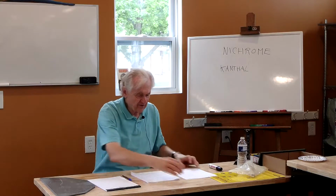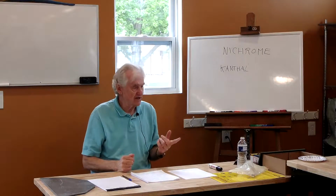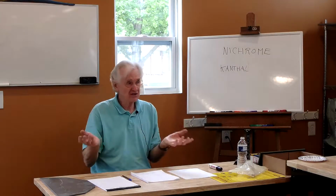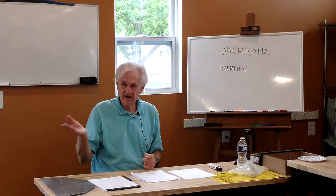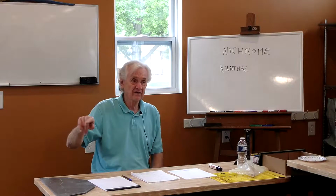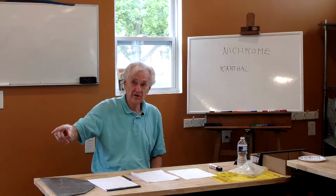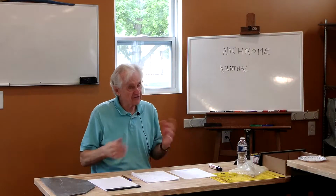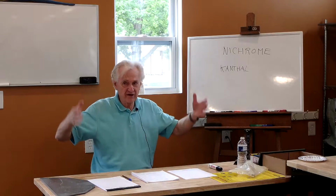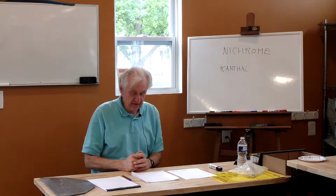And the other thing with the more modern ones, they're all very well insulated. Did you all see the insulating fire brick and see the difference in the weight? As you can imagine, along with the weight, the lightweight brick is a lot better insulating than the heavy brick. And the blanket is even a lot better insulator than the brick, even the lightweight brick. So at least in industrial kilns, a lot of the kilns now are lined with blanket. They might use brick for the outside, like a shell, or even metal, and they're just lined with the blanket.